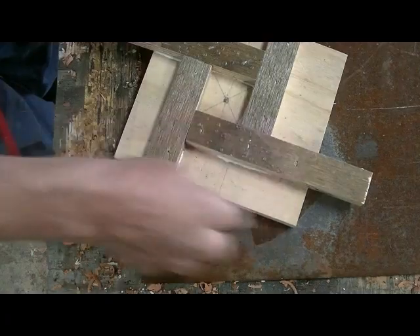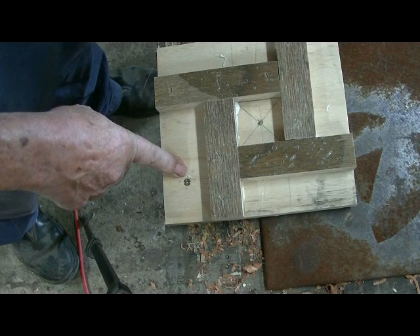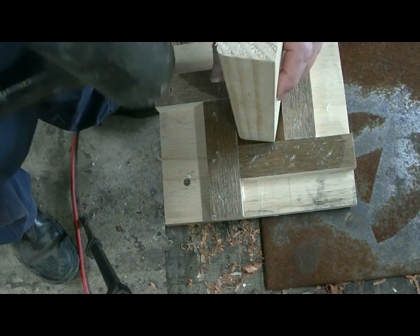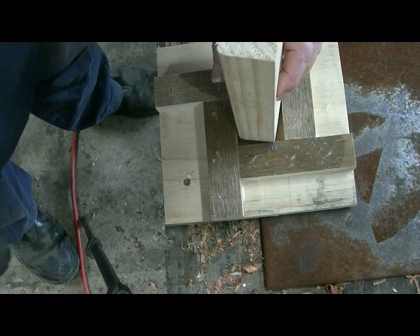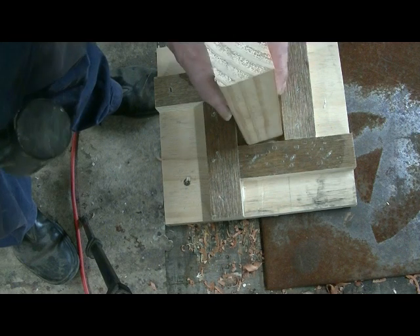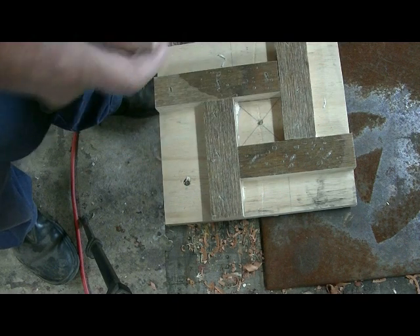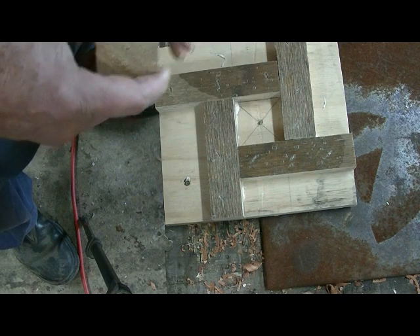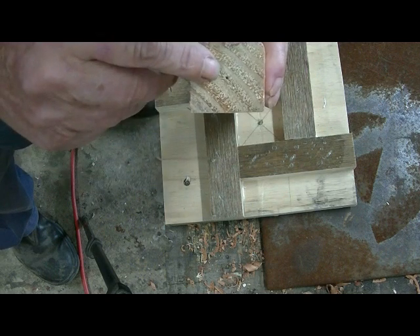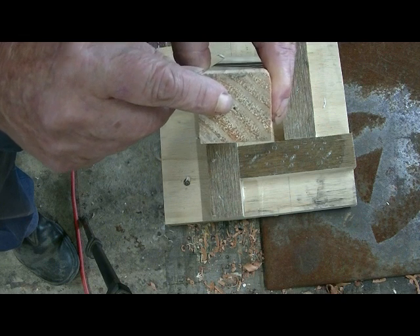Now we go over to the saw and trim these bits off here. The way it's used is you screw it to the bench so it can't move — and this is where it gets its name from. We call them bonking boards. You put the bit of timber in clockwise like that, put it down onto the screw, bonk on the head, then anti-clockwise and it comes off. The reason you've got to do it anti-clockwise is because there's a little bit of thread on the end of the screw and sometimes it can get jammed. And it leaves a nice little centre hole like that, ready to put straight into your spur drive and your tail stock centre.